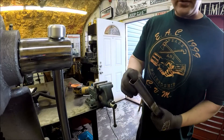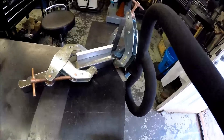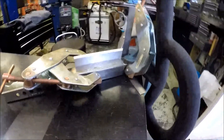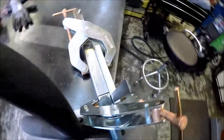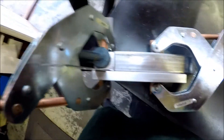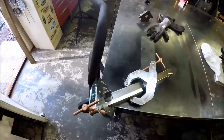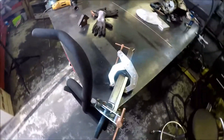Let's get the handlebar welded on. Sometimes you've got to get creative with your setup, so I'll show you what I had to do here to get everything in squareness and right with the world. I had to shim this a little bit here to be able to hold her down. This piece is keeping everybody straight, and I've got a spacer on the bottom and a spacer here so I can get this thing tacked up. I double-checked to make sure this notch goes away from the handlebar — don't want to be a bozo and have it the wrong way when I weld it up. Let me get this thing tacked up.